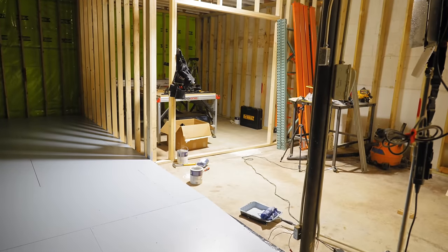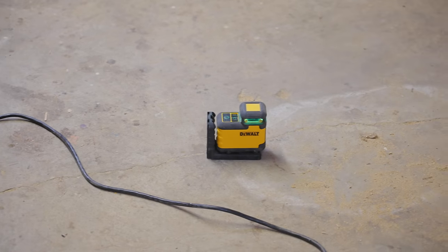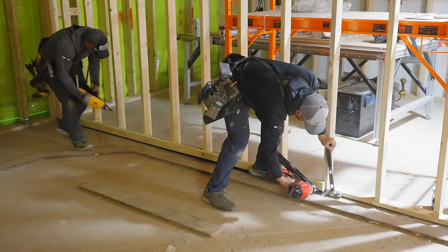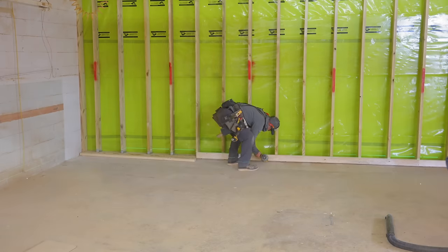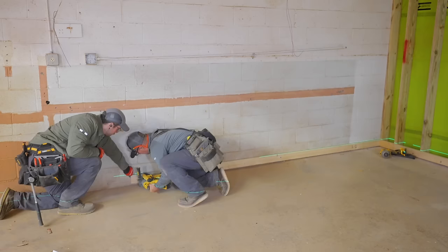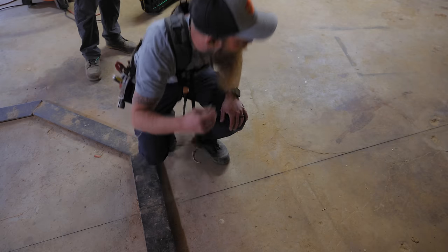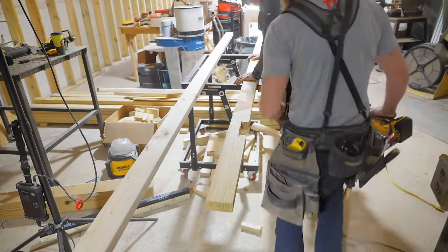We could now move on to building the platform, which needed to span the area between the spray room and the CNC room, so we had to frame the CNC room first. To get started, we set up a line laser at three-and-a-half inches off the ground representing the top edge of the platform framing, got the first board lined up with the laser and nailed it to the wall, then moved on to the second board. We repeated the process along the back wall — these boards were about an inch off the ground along the wall, showing just how sloped the slab was. We got the boards attached to the outside of the spray room with concrete anchors, installed the rim joists on the front edge, snapped a line, and notched the boards where needed to fit around the frame straightener.